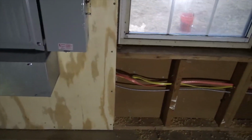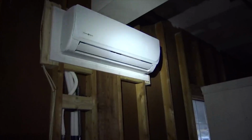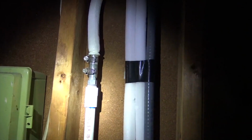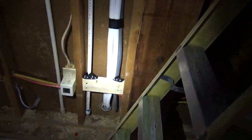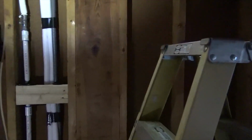There's some other features the customer wanted to add to this garage, like one of the AC/DC 12C mini splits from Hotspot Energy. Sorry about the flashlight and the lighting. And see where this gentleman's transitioned the condensate line to the drain using barb fitting, made his own little coupling. Line set was a little short, so he had to braze on some extensions there. So we're ready to fire this thing up on solar.